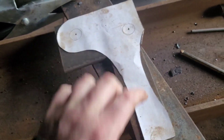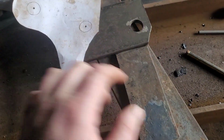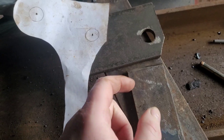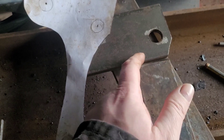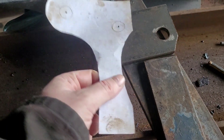I laid it on, marked the steel and cut it. But before doing that I ground both sides so it's like a V, and I'll leave a little gap so when I weld it the welding will go right to the middle on each side. When I grind it off it'll have welding all the way through holding it, so it'll be plenty strong.